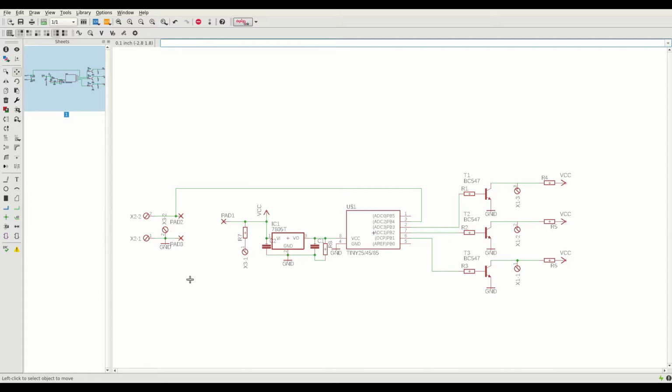That just doesn't go over 2 amps, and it just holds 4.2 volt constant. The only thing you have to keep in mind is that you don't leave it on the charger indefinitely, because then it will keep charging it. It will float charge it, and that's potentially very bad for the battery. But if the user is halfway sensible and you tell him to just leave it on there for an hour, you'll be just fine. An hour or two. Yeah, that would be just one LM317 regulator, just whack it in, be fine.